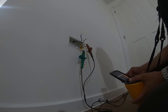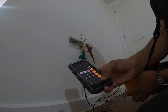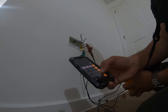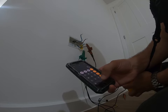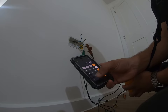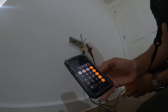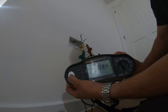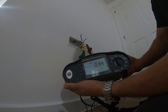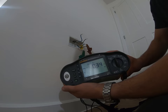We had 0.49Ω for the neutrals and in an ideal world the live should be 0.49Ω as well, but we've got a loose connection somewhere. The live and neutral conductors are 2.5mm² with the CPC being 1.5mm², so we'd expect the CPC readings to be 1.67 times higher than the line and neutral. Taking our neutral continuity of 0.49 and multiplying by 1.67 gives us an expected reading of around 0.82Ω. The reading is way below that, but this doesn't cause concern because the boiler is connected into the ring and has a 10mm earth bond back to the MET, so we're experiencing parallel paths.